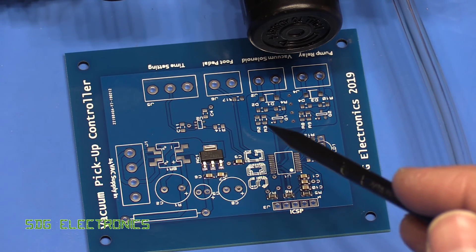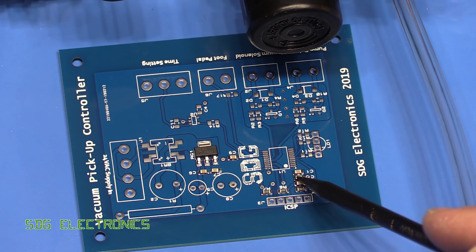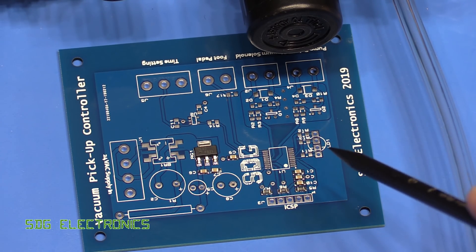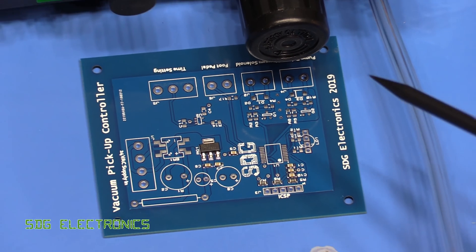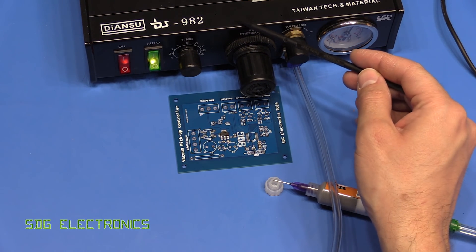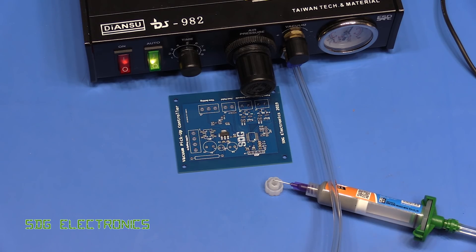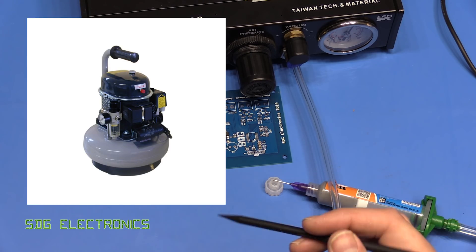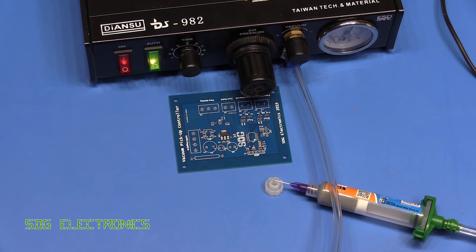The reflow process was a lot better this time — it dragged the components in really well. I had a little bit of trouble with some parts because I couldn't see very well without the microscope set up today. But not too bad at all. You can buy these for $35, though you do need a compressed air supply. I'm using a little compressor which I'll post a link to below — the direct piston ones are really noisy but they're the cheapest if you're on a budget. Hopefully that was useful, and until next time, thanks for watching.